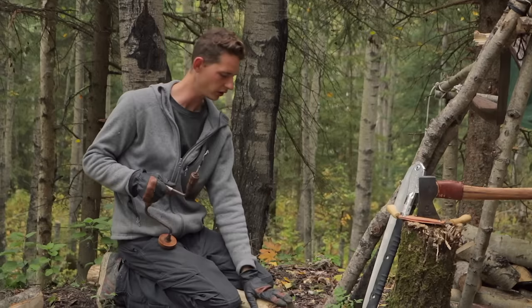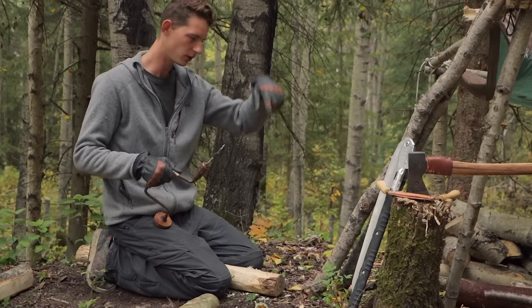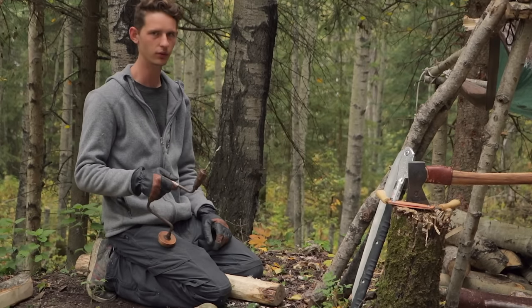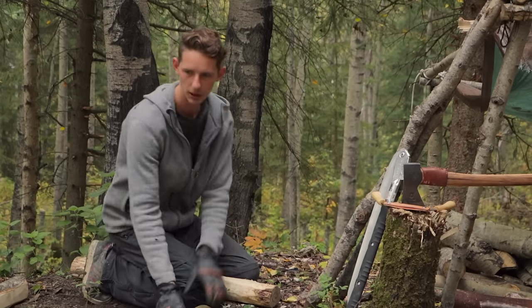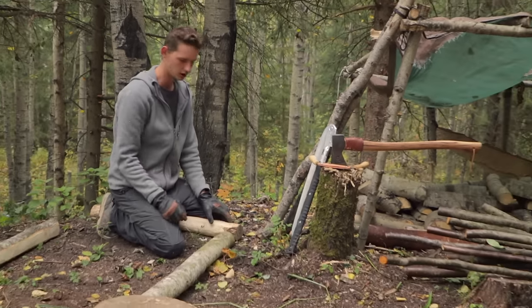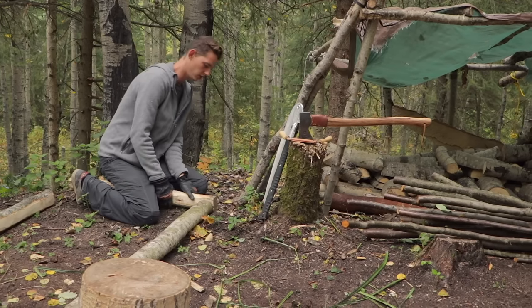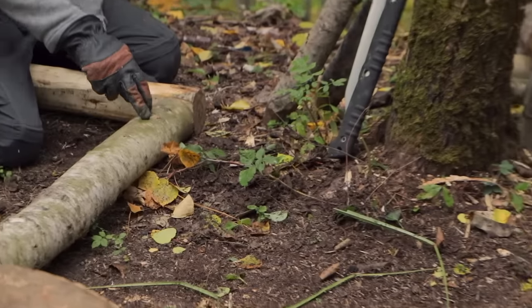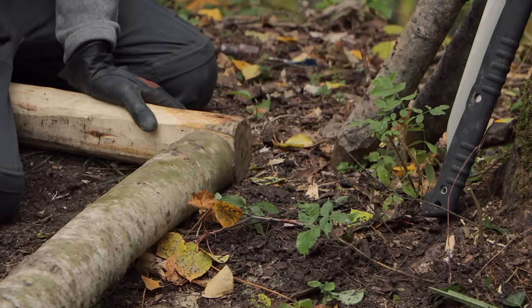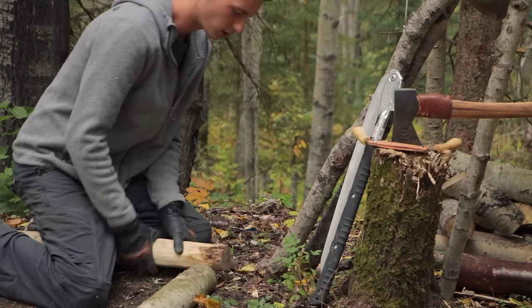This is the top horizontal portion of our rough door frame. And we're just drilling in from the top so that we can dowel into the top of the vertical supports. So pretty much this is our hinge side of the frame. And then this is gonna get drilled out and fastened in here, and then we're gonna run a dowel right through into this piece. Makes sense? So you're gonna drill a hole? Gonna drill a hole.